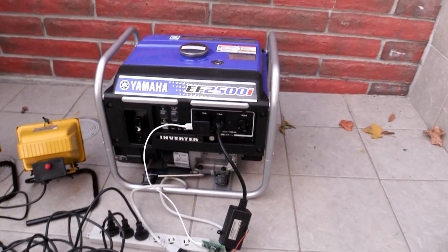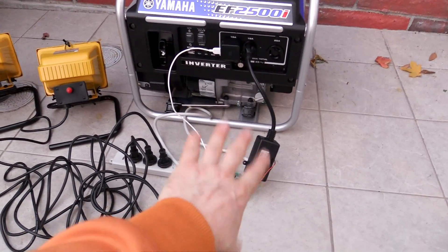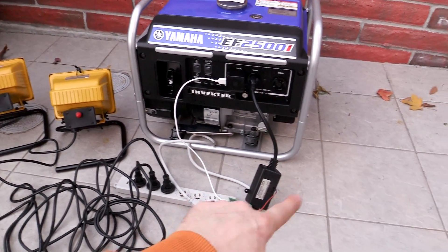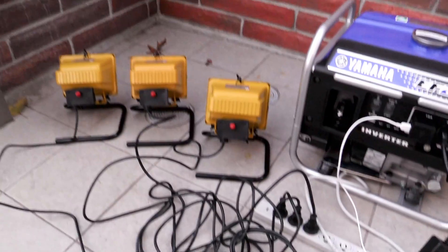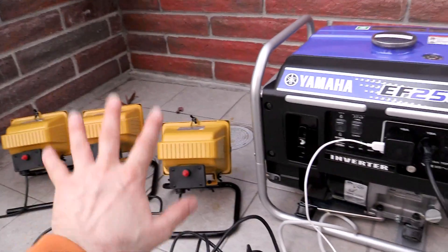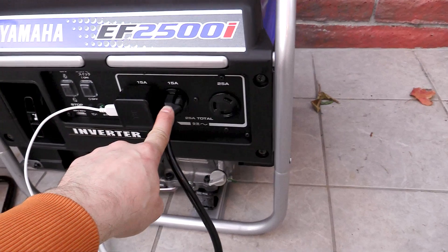So we've got this thing ready to start. Now we've got to have our setup. I'm using three 500 watt lights, because my system here can only switch 15 amps or 1500 watts. I would like to have more because this generator is good for 2500 watts, but it'll do. We've got our three lights all connected up to a power board so they're going to come on and off all together. That's coming through this thing here, and then back up into our generator's 15 amp outlet.